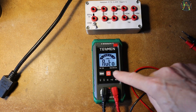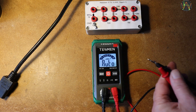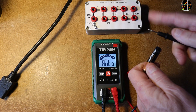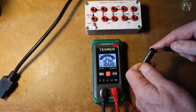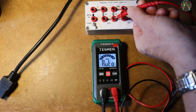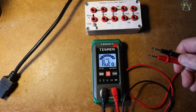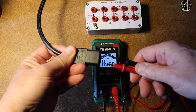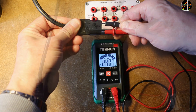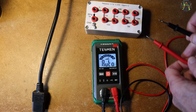Finally, if you have not seen a smart meter in action, here is an example of everyday use. All you have to do is turn it on — I turn the backlight on too to make it easier to read. I grab the leads and measure a battery: the meter automatically switches to DCV and shows 1.6V. Then without pause I measure a resistor and the meter switches to ohms showing about 1KΩ. Then I shove the probes into a mains power cord and the meter switches to AC and tells me we have 240V AC mains. And finally, a bit of continuity testing on a screw — all without touching the meter at all.